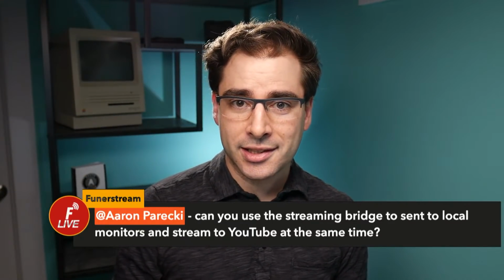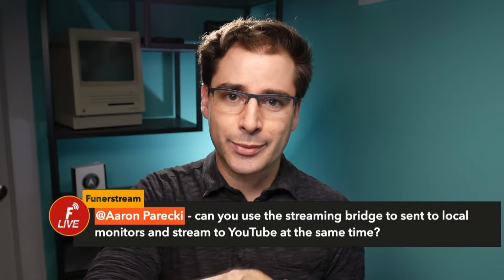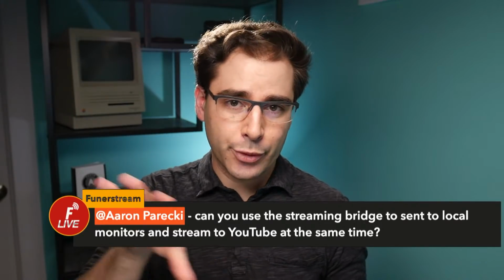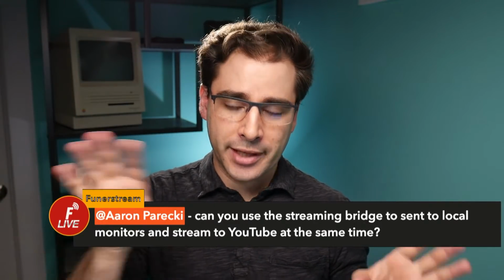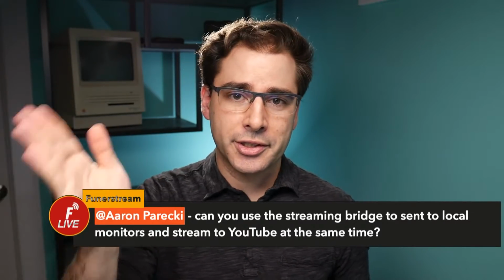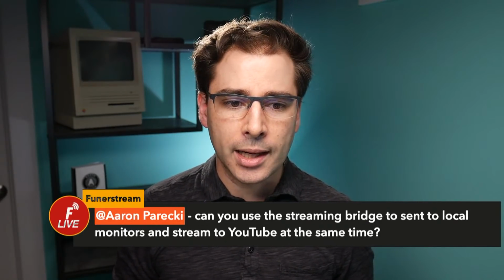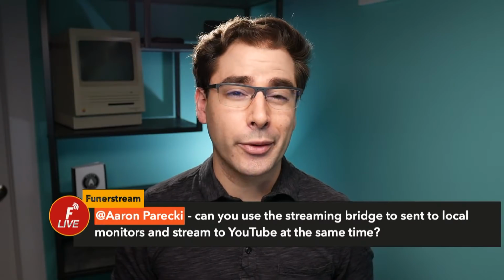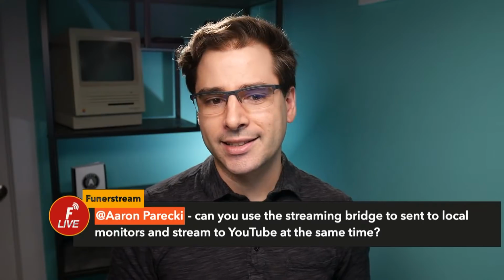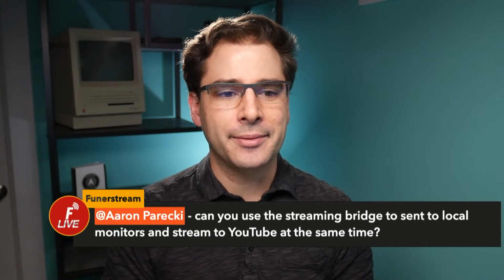The question remains as to whether the Stream Bridge is a generic RTMP server, in which case you could use a proxy service, like Restream or whatever, to stream from the ATEM to the proxy service, one then going out to YouTube, one going to your Streaming Bridge. That's going to start to get weird. Not sure how well that'll work, but it might be possible. But it's not really possible to do two streams out of the ATEM Mini yet.